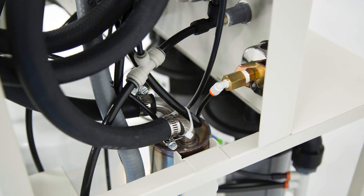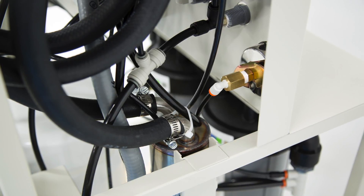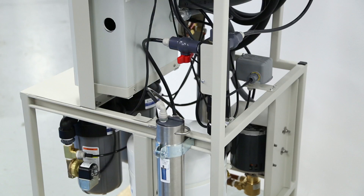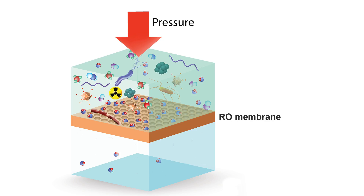The system may seem complex upon initial inspection of the unit plumbing. It is helpful to isolate the unit into subcomponents and learn the water flow path. The most complex section is the RO system, where 98% pure or better water is produced by pumping supply water at high pressure through extra low energy membranes. These membranes are comprised of several layers of a material fine enough to strip almost all dissolved solids out of the supply water.